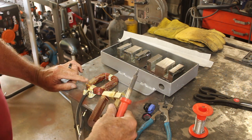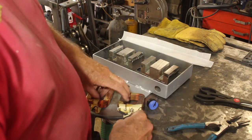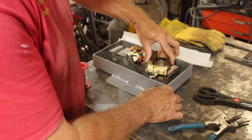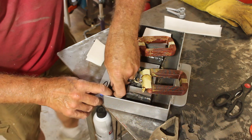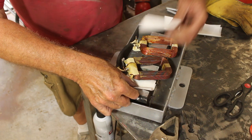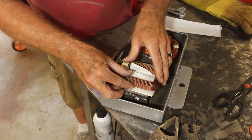On this side I've got the negative on the inside start of the winding, so on this one I want to put the positive on the inside start of the winding. This is something you always want to do first — make sure any hardware that's supposed to be on the inside is on before you solder the wires. I've got a nice rubber o-ring there to seal it on the inside, and finger-tight is plenty good enough because this thing's getting filled up with epoxy. I don't want those copper windings to touch the steel, so I'm putting some parchment paper in between them.